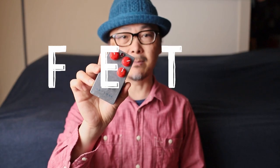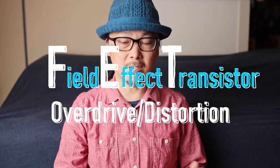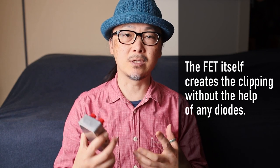And what I mean by that is this pedal is an FET based overdrive. So it's using FETs. I think specifically in this I have MOSFETs instead of JFETs. But it's using FETs kind of sort of like a tube in a tube amp, meaning that there are multiple amplification stages running into each other, and then it naturally overdrives that FET. So there are absolutely no clipping diodes in this type of an overdrive. That is said to sound very crunchy and has this breakup characteristic that lends itself more to something like a tweed amp or early plexi amps.